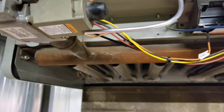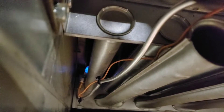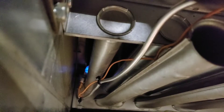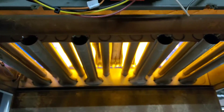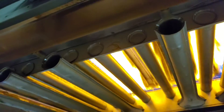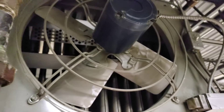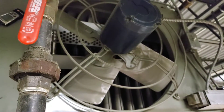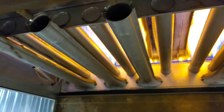There goes our motor, there's our spark, there's our flame — right away, instantaneous. There goes our main flame. And then next should be our prop fan — there we go. We're up and running. Let's take some combustion analysis of this unit.